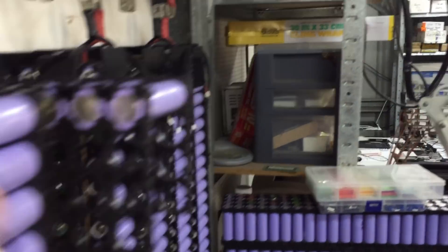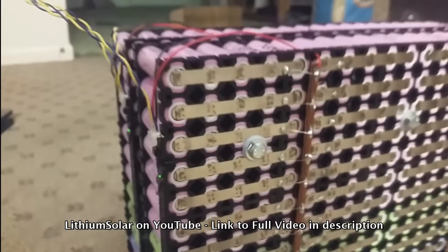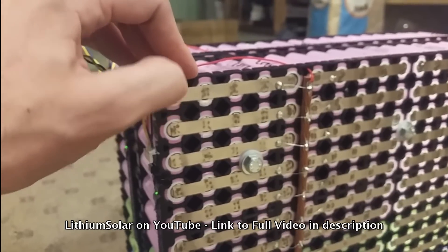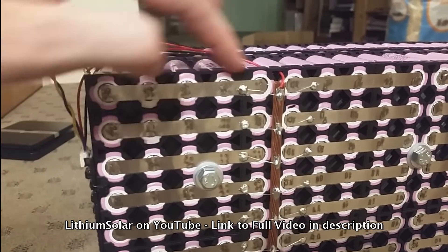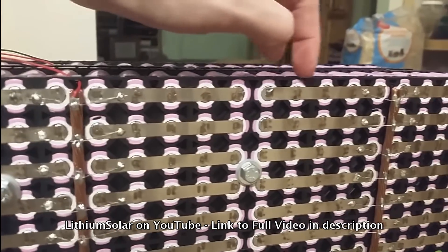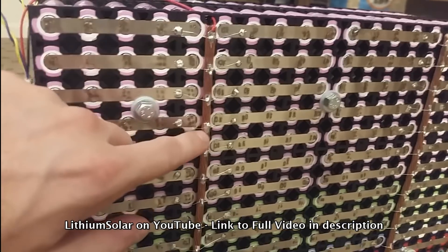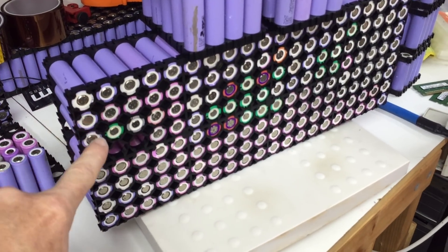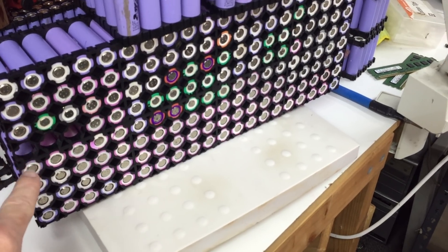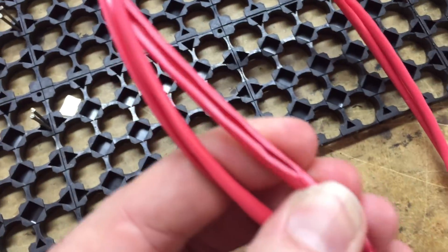Now I've got to work out the bus bars — I want them to come out exactly the same as here. If you have a look at Mike Neko's last video: what I'm doing is I got this 0.15 millimeter nickel strip, bought from Keith's store, and I did groups of five cells — each row has five cells, then it stops, five more cells, stops, five more cells. For the bus bar I used four-gauge copper wire, twisted THHN. He's done some very big packs — maybe 300P — with nickel strip and just soldered one fuse to the bus bar. I like that idea, so I'm going to copy him.